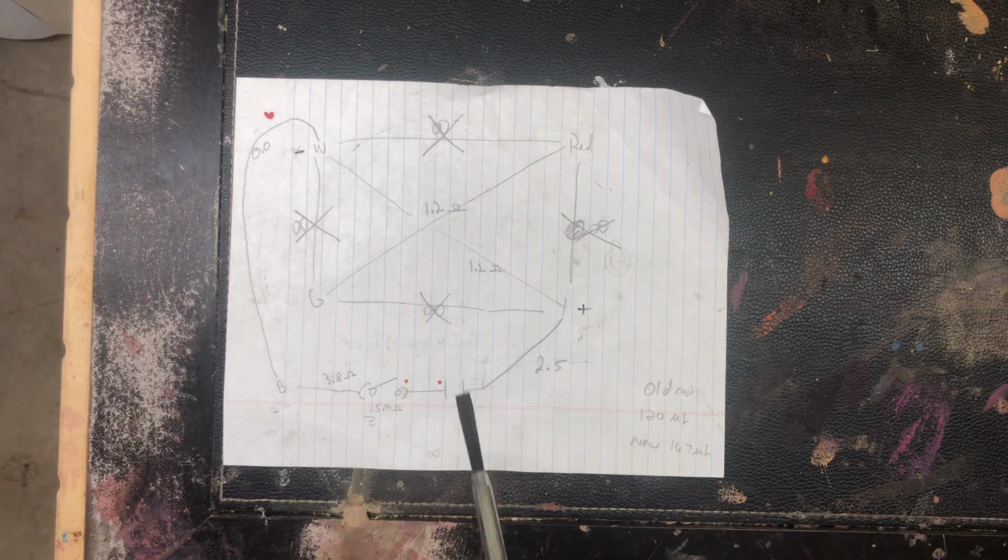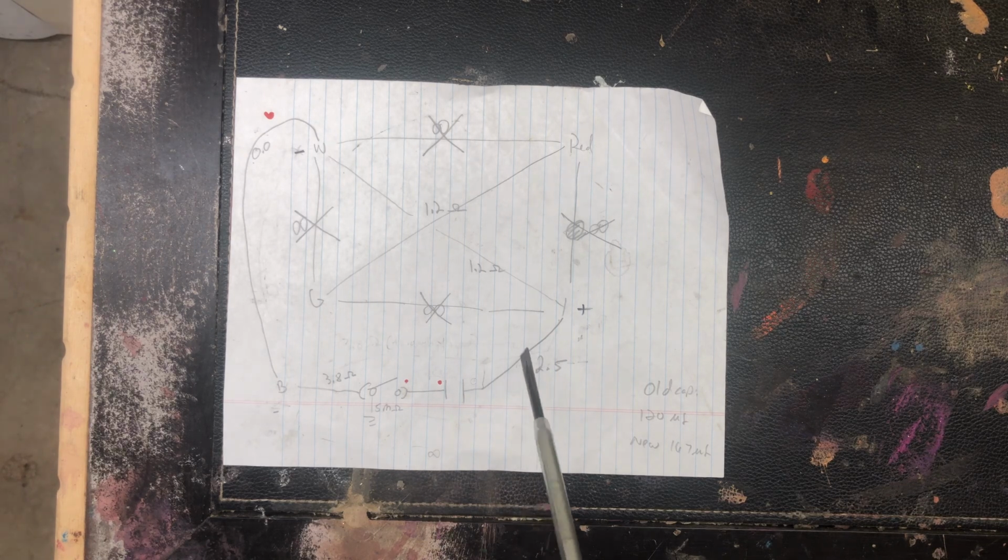So once I had this in hand and I was sure that my wiring was right, that's when I discovered that I forgot to strip the wire. Once I got that, it would actually start, but it was starting poorly. That's when I discovered the friction problem. I fixed that, and so on and so on. All in all, it was a little frustrating, but I kind of like doing this because now I know how to fix an induction motor.